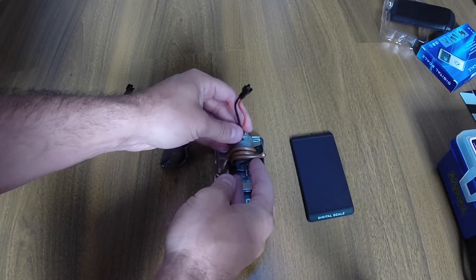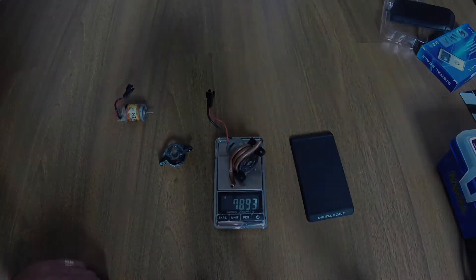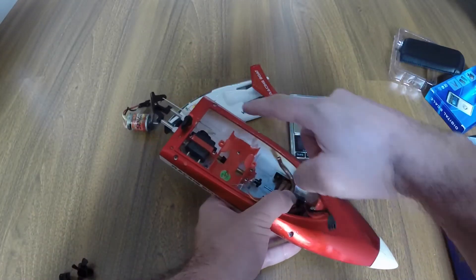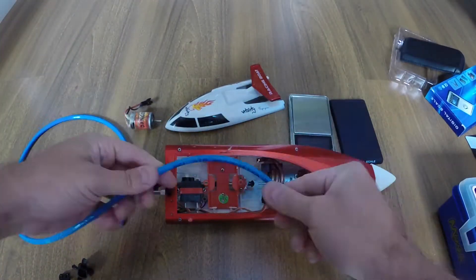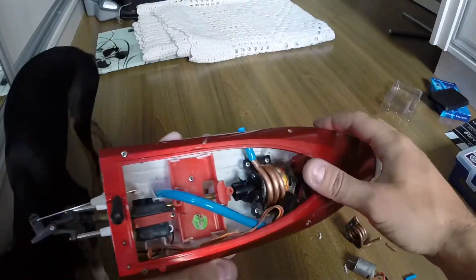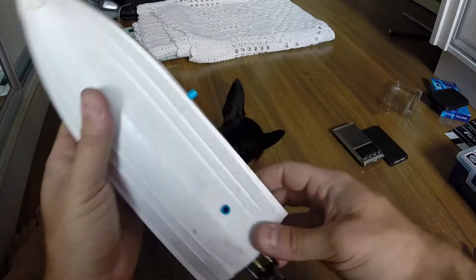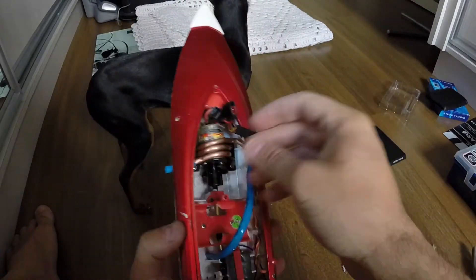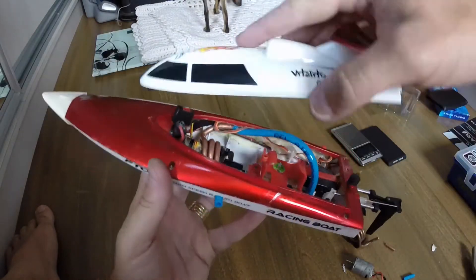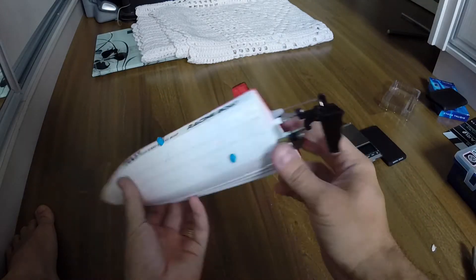The total weight is about 78.9 grams. Now for placing the tubing on the motor, you need to think about where you'll put the intake and the outtake. I'm using this blue plastic tubing to make the connections. The intake goes in at the bottom, then the water goes around the motor and comes out at the side. The plastic tubing is the easiest way to connect the copper tubing.